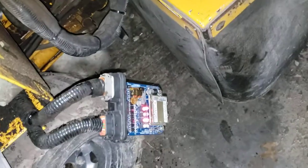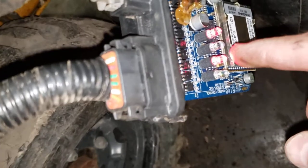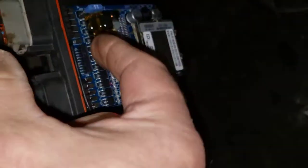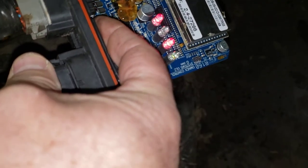We're going to turn on the remote control power, and down here we see the second LED — that's red — which is the link LED. Then we're going to hold this setup button down until the green LED starts flashing quickly.